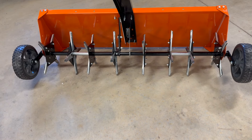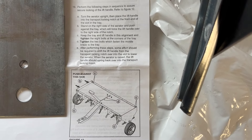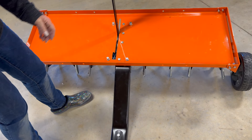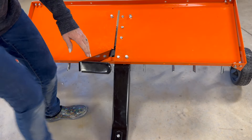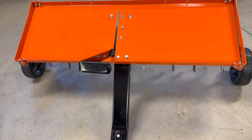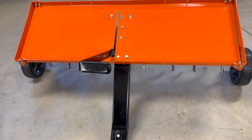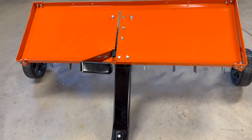Both are tight now. Home stretch — put the cute little rubber handle on. Step 18 and we will be finished. Turn it upright, place the lift handle locking notch at the front — you should be able to release it now, the tray goes down, and that's how you aerate. When you want to drive with the tines up, pull it and it'll pop right in there — works perfectly. Tighten all eight bolts in the four corners, then tighten the two that fasten the middle brace and the tray. Houston, we've got liftoff!